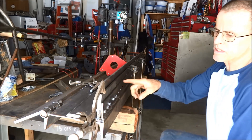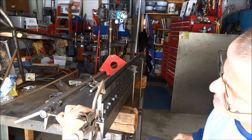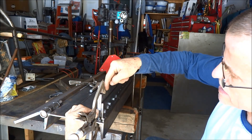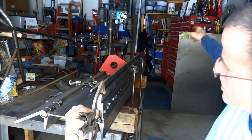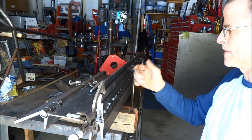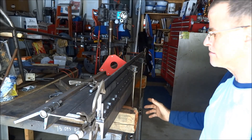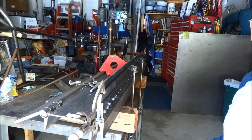I'm having to drill through these holes to clear for the spacer. I bent a small spacer — it may be kind of hard to see at an angle — to make sure that this plate would slide in easy enough. That angle comes down, and as I was drilling holes in the drill press it was moving around a little bit, so I got it all clamped in place, drilling it to make sure it's not going to be pushed up so that everything will be the right height when this seats in. It'll all come together.